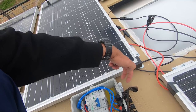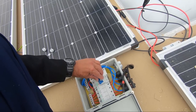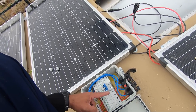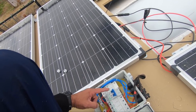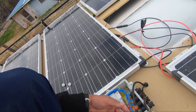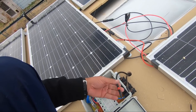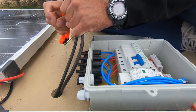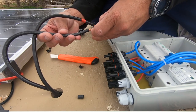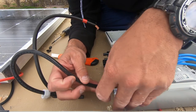The power comes in through these two glands right here into this circuit breaker. Positive is this side and negative is this side — it's marked. I've got to get these through the gland, and because it's such heavy wire it's going to be tough. We also have to strip this back to get them into these terminals. Stripping big wire is hard — and we have to have the gland on first or I have to take it all apart and do it again.